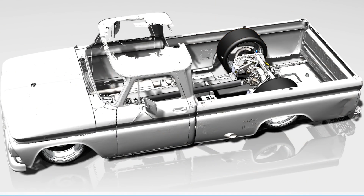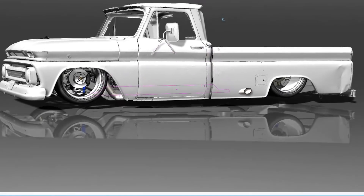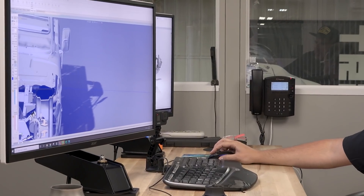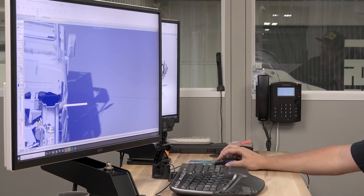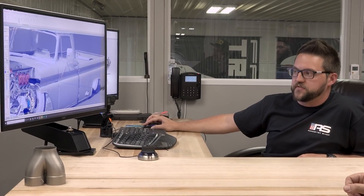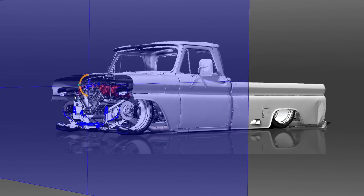Right now we're running a 22 in the front and a 24 in the rear. The 22 we had to do because we need it narrow enough and small enough in diameter so we can have enough articulation left to right, lock to lock. With a 24, it left you with hardly any turning radius whatsoever — because you're tucked so far up inside there, even at ride height. You've also got the actual inside of the hood line where the seam is, and you need enough bleed room that when this does air out, you're not plowing straight through there. You have to rethink how the front fenders actually mate, whether it's a tubular fender core support system, making sure you have that turn angle at ride height.